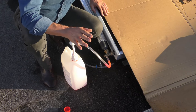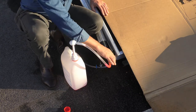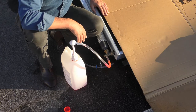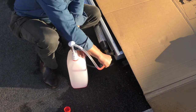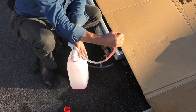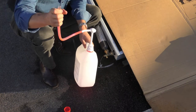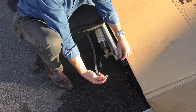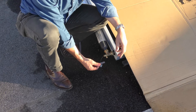It's not a problem if you're not using that water to drink — if it's just water that's going to run out. But any excess running out onto the roof, if it gets into the rainwater system, could be a bit of a problem. So make sure you clean it up. Just make sure that you don't let it run onto the roof — clean it up, wipe it up straight away. So now we've got this closed off. We've put our glycol in there — five litres of glycol. We're going to put our hose back on now and mix it, so we still need about another 11 or 12 litres of fluid to put in there.